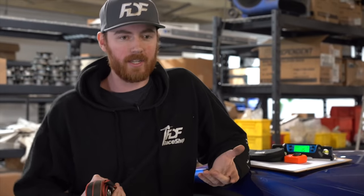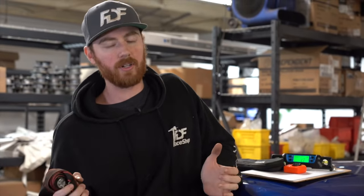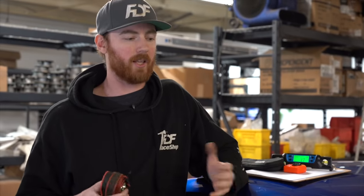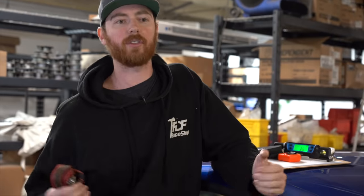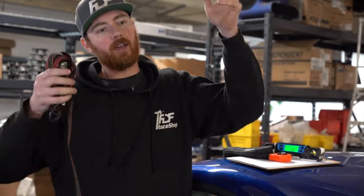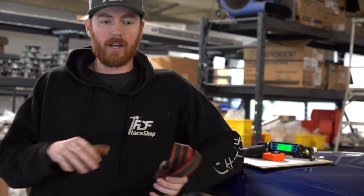Well, when you're fitting a tight-fitting roll cage, and especially when you're about to drop the cage to weld the tops, you're going to need a ratchet strap to pull and manipulate the tubes in a way that allows you to move the cage around in order to weld certain areas. So for example, if the main hoop fits tightly against both B-pillars, we can put the ratchet strap around the tubes, bring the tubes together so that we can drop it off of the rocker, and then lower the cage and weld the tops. Once we're done, we can lift the cage back up, let the ratchet strap go, and the tubes go back into place.